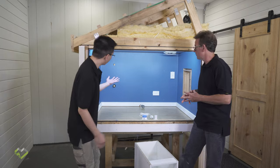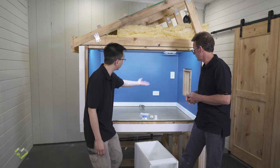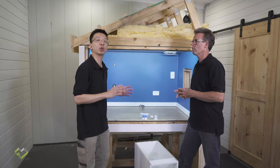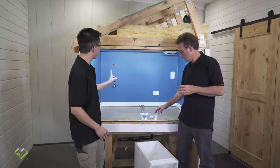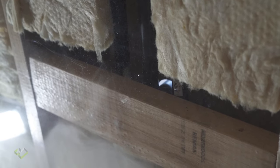Let's look at all the surface penetrations, including the plumbing, electrical and also the exhaust. All these components are penetrating what we talked about from the last video — the plasterboard, which is called the air barrier. So we need to deal with them, checking how we're going to reduce any air leaks or the gaps between those holes and the plasterboard.